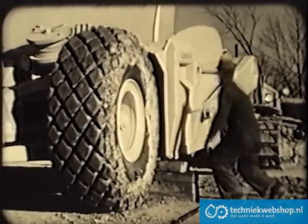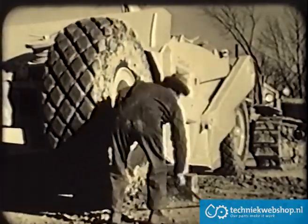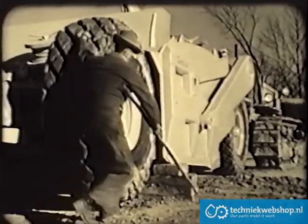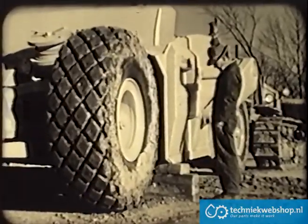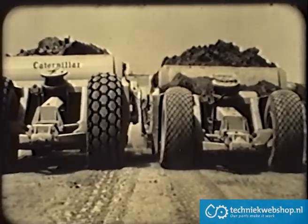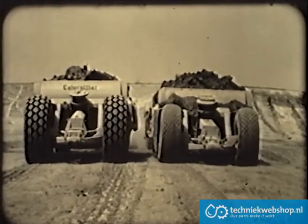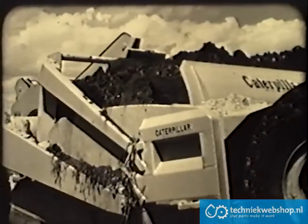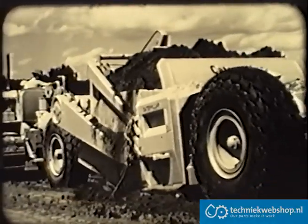By placing blocking under the raised bowl and then lowering it, the rear end of the scraper can be raised. This makes it easy to check the tire and wheel assemblies for any necessary take-up, and this same procedure makes it easy to change tires. Two Number 70 scrapers illustrate the optional tire sizes available for the Number 80 and Number 70. Large diameter, low-pressure tires reduce rolling resistance and improve flotation. Out-of-pocket costs are also lowered as tires of ample size give longer life under heavy loads. The owner can select the tires that best fit job needs and be assured of maximum performance even under the most adverse conditions.